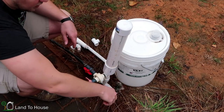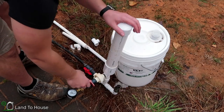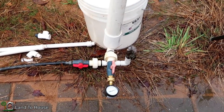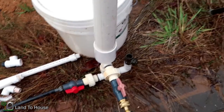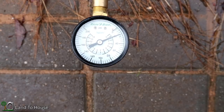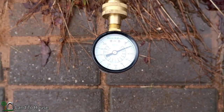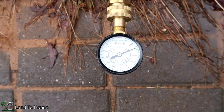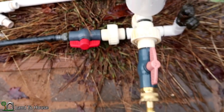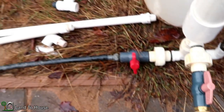I have to get this thing primed real quick — I might have to add more tape to my pressure gauge. The pump has been running for approximately 2 minutes and it looks like it has reached 20 psi after about 2 to 2.5 minutes. So that's going to be our test starting point at 20 psi. Let me go ahead and close this off, I'm going to relieve this pressure, and we will add a standpipe.